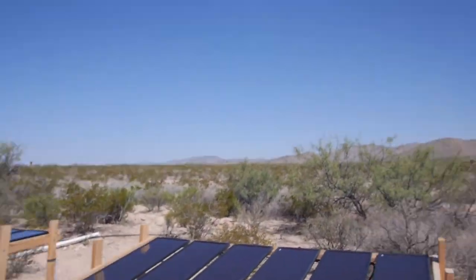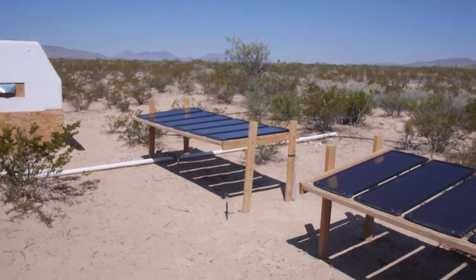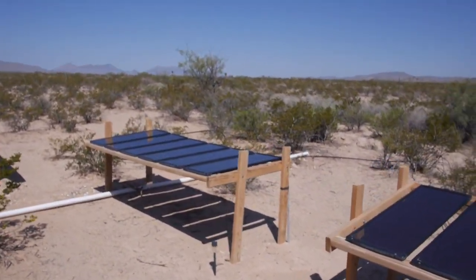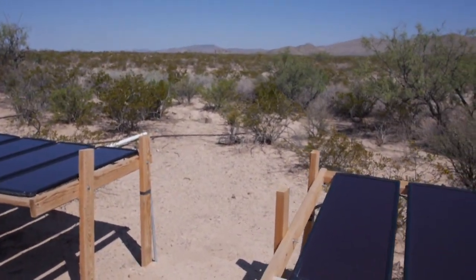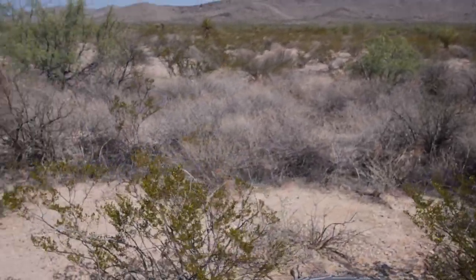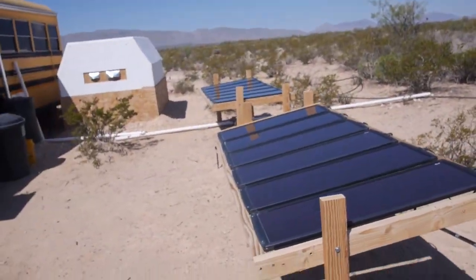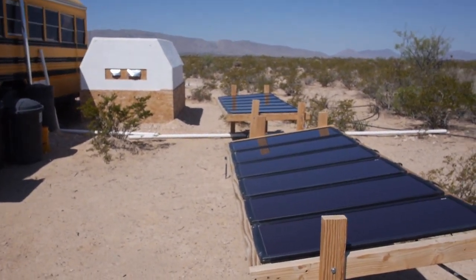I love the sounds out here in nature. Today is September 9th and it's 11 o'clock in the morning. These panels have not yet been adjusted for this time of year. I'm going to adjust them the week of the 21st — that's fall equinox. I may not have very accurately measured these in the first place. If you look from the end, this one is a little lower, that one is a little higher, so they don't match — at least one set of holes is wrong.